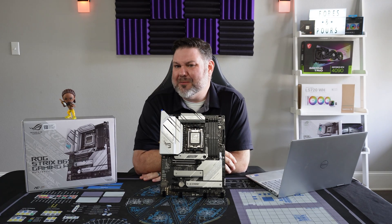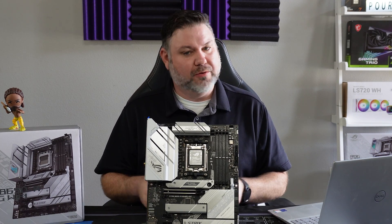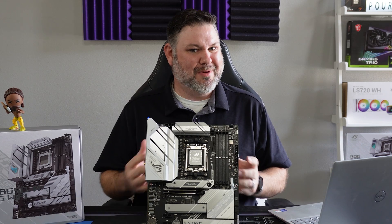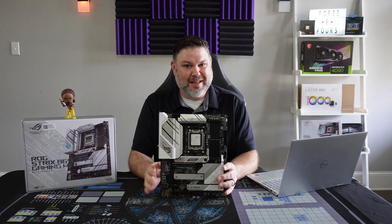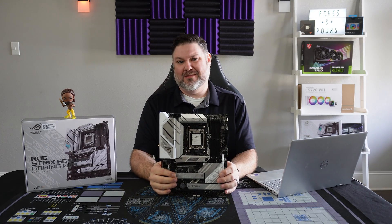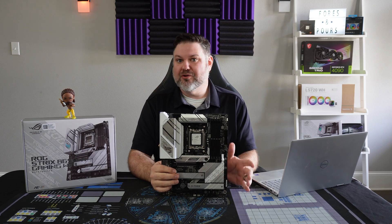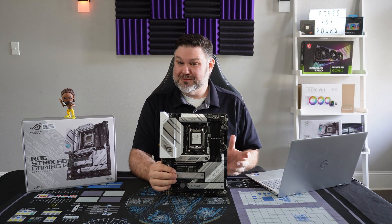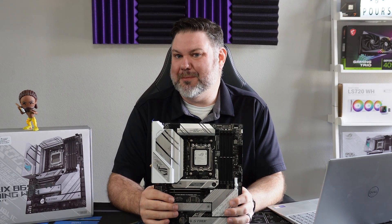Well, that's something I've touched on in previous reviews — power phases are an area where manufacturers tend to overbuild. It's an easy way to price up a board without actually impacting the manufacturer's overall BOM cost. So I'm happy to say with 12 power phases rated at 60 amps, this board is going to offer more than enough power to handle even the beefiest of AMD's 7000 series chips. Now, if you are a hardcore overclocker rolling with something like the 7900X or 7950X, this might not be the board for you.